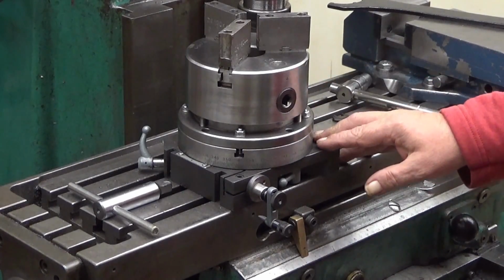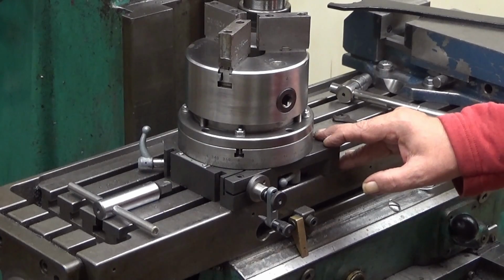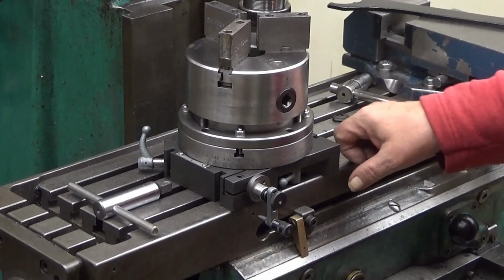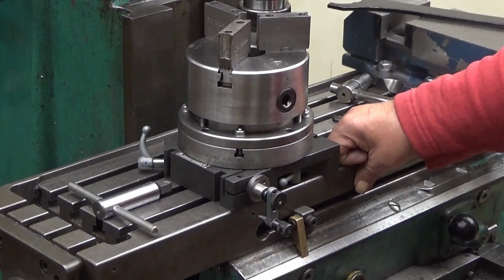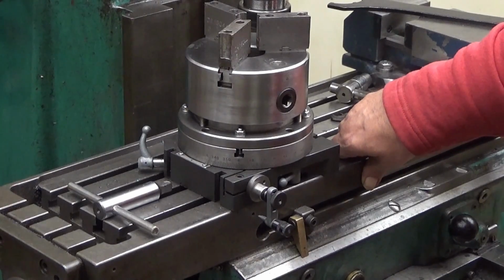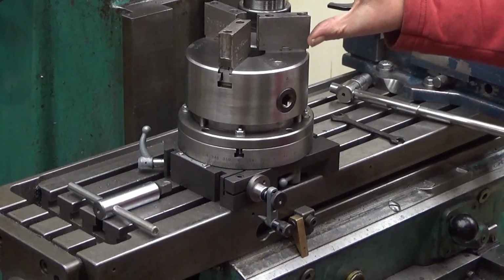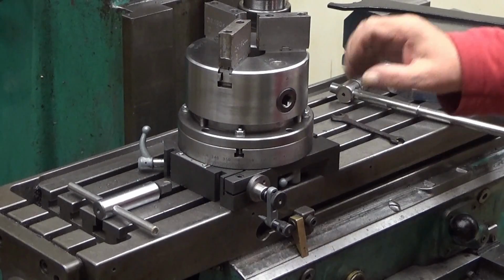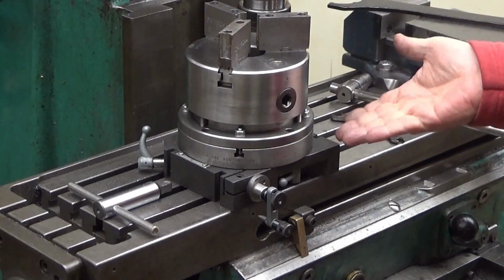And then you could use no chuck at all. You could just use the table. Okay, that's also one option. And then you get over 100 millimeters of more space between your milling head and your table. And yeah, okay. So I think the vertical dimension of this one is a little bit too much. That's just my opinion here. At the moment, I have about that much more. This can go that much more down, and then the maximum is reached. So I have very little space here on top of this. So this milling machine is not very well suited for high objects like this one.